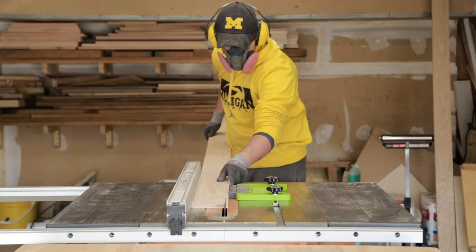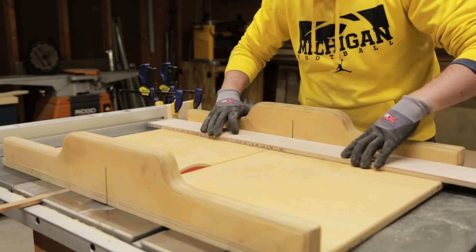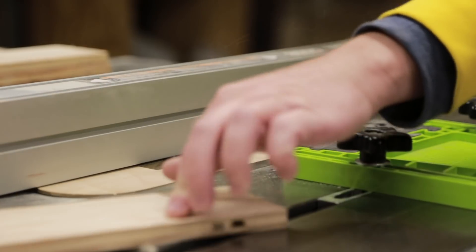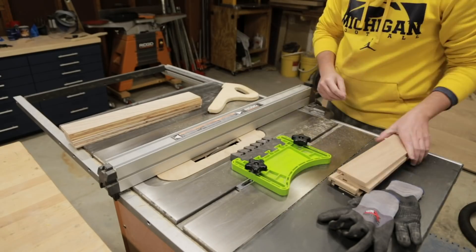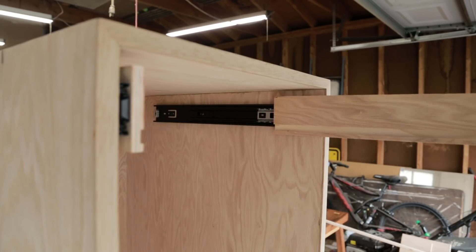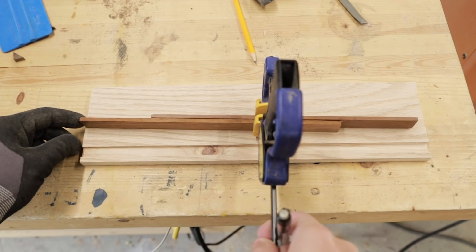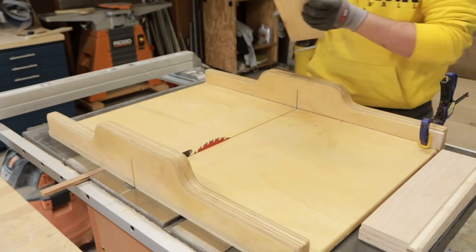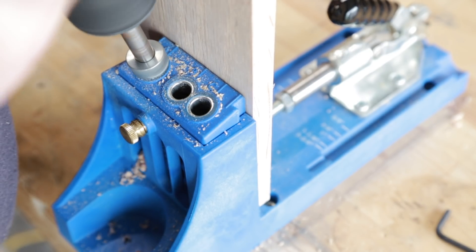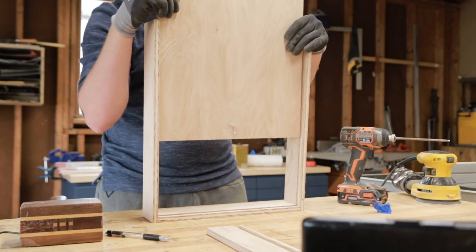Now that I have the carcasses done, I can start working on the drawers for the left tower. Using half-inch ply, I started by ripping down the sides and cross cutting them, leaving a little extra for the front and back. I then cut a half-inch dado to accept the plywood bottom. I did three different drawer sizes: three inches, three and three-quarter inches, and five and three-quarter inches. To find the length of the front and back, I use a simple trick of using two pieces of wood and a clamp to fill the space in between. To assemble the drawers, I'm using pocket screws drilled on the fronts and backs, which won't be seen as the front will be covered with a false drawer front. After assembling three sides, I slide in the bottom panel before attaching the fourth.